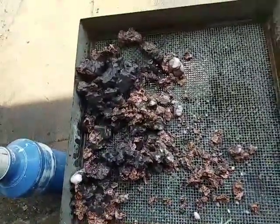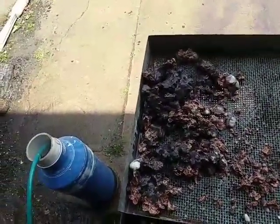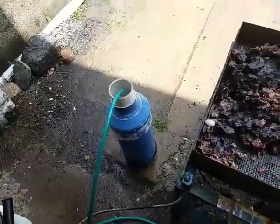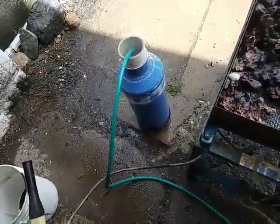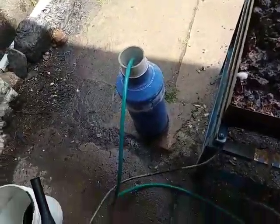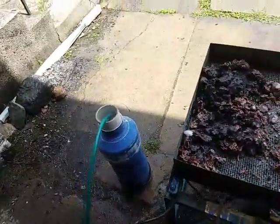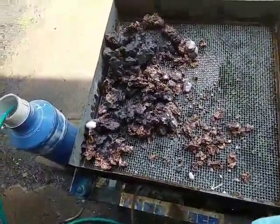It takes a few days and it's a lot of work. It's all done in a tumbler and then by abrasion. You need to do it in something really heavy duty — you can't use a rubber-lined drum or you're just going to tear your liners up. I made that mistake a long time ago and never again. So I actually built this one barrel — I have several of them — and this is made out of really heavy gauge Schedule 40. It cost me quite a bit because the fittings were like $50 a piece, but it's the only thing I've found that holds up to the force of the copper, because it just really beats your tumblers up.